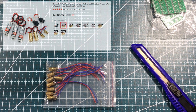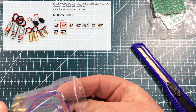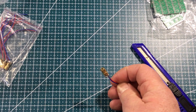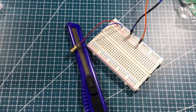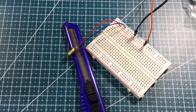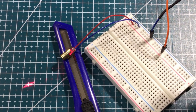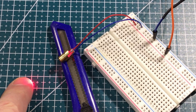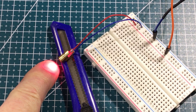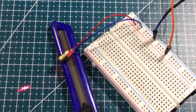Oh, little lasers. I've been doing a little bit with laser gates recently and just wanted to try a few different low power lasers. Watch your eyes — I've got five volts and it's current limited to around 80 milliamps. Better connections would help. That's pulling about 20 milliamps — nice little laser, actually pretty low power. If you put a photodiode at the other end you've got yourself a nice little trigger for whatever you need.